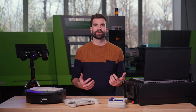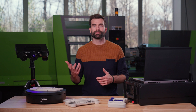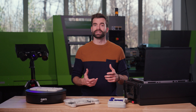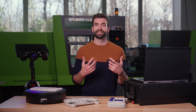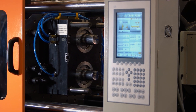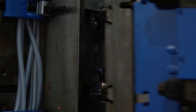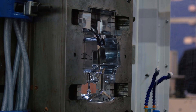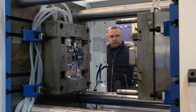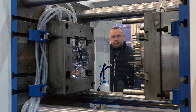We all know plastic parts, either injection molded or 3D printed, are subject to an annoying behavior: warpage. This is the unwanted deformation of the part caused by the production process. Plastic injection molding is a complex production process, and even with the best simulation software and complex mold correction, the resulting parts will most likely still be warped. For good quality control, warpage is quite challenging.